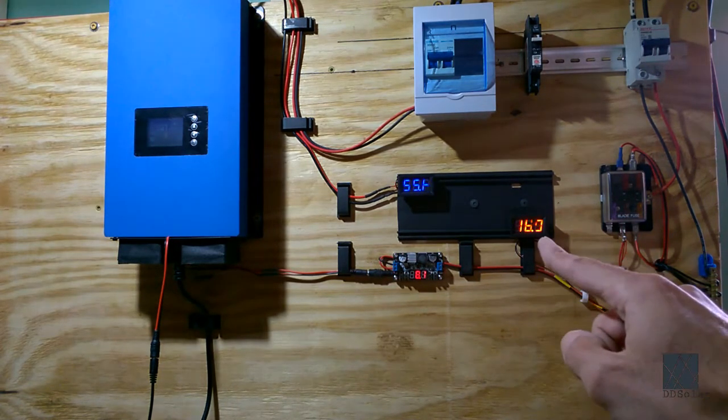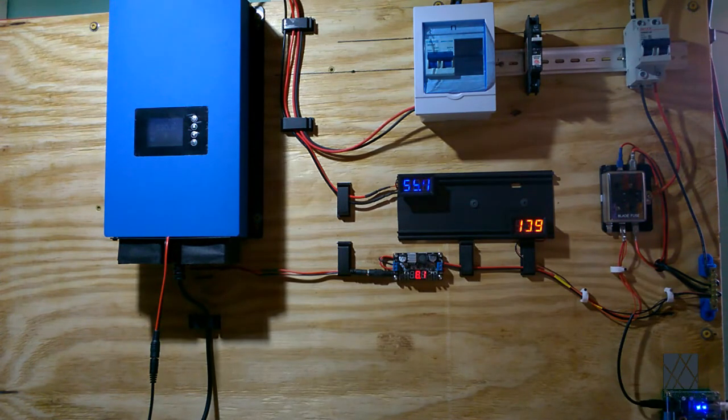On the right you can see an orange voltmeter showing the voltage of the two 100 watt solar panel array. The inverter on the left has had its fans modified — I could no longer stand the fan control algorithm in that inverter, so I opened it up, cut out all the wires feeding the fans, and took over the fans myself. There are now five fans on this inverter using two separate redundant power systems, one of which is solar powered. The inverter fans turn on, stay on, don't make annoying sounds, don't blip and rev every time a cloud comes over, and there are no glitches or weird behavior.